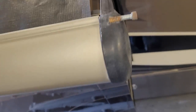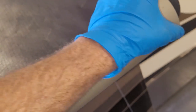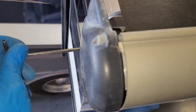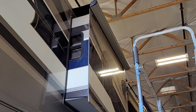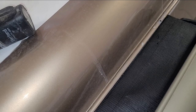Now I just have to flip this back up and put those bolts back in. Remember, it's threaded into the cap here — all it's doing is becoming a pin holding this aluminum wrap on. Let's tighten up that one and tighten up the other one, then tighten up those other three. That's pretty much it. Now I just have to go inside, run the slide-out room in and out a few times, and then put the set screws back in. With the slide-out room back in, I put those set screws back in again — that's going to keep it from walking around.